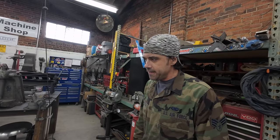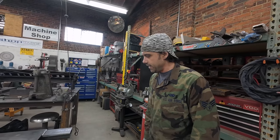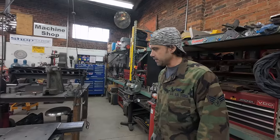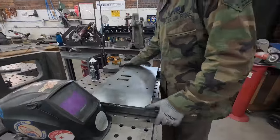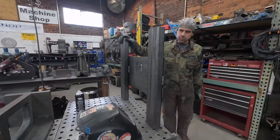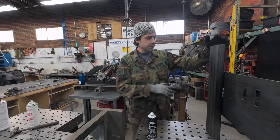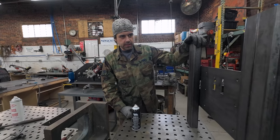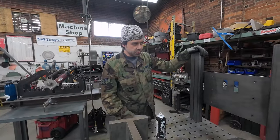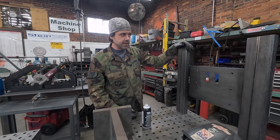Making a box now on this, kind of getting these two panels, and everything is very heavy on this. Everything's quarter inch, so it gets substantial very quickly. But basically, these are the sides. We've got two of these structures on here, welded those plates on there. Be another one right here. I'm gonna drill and tap so we can bolt on the front faces with the actual logos on there. The X's. Yeah, and that'll allow us to take it apart and move it.